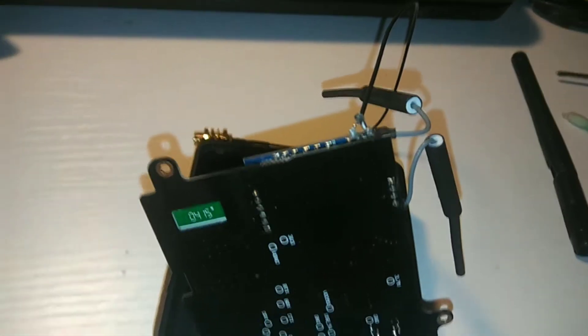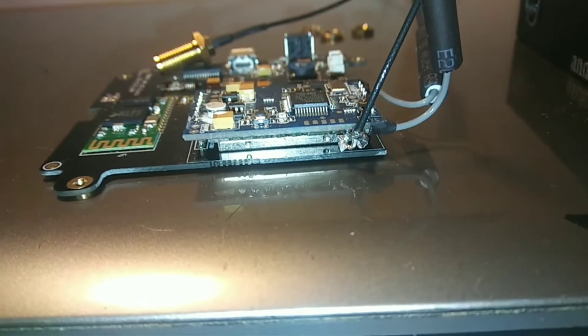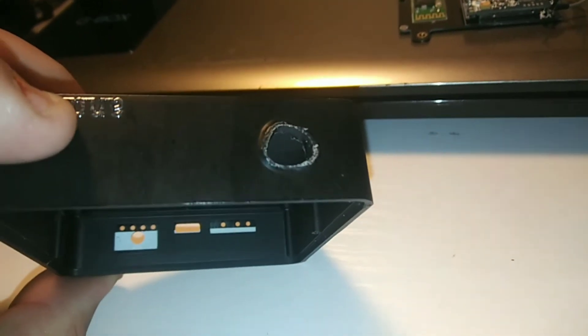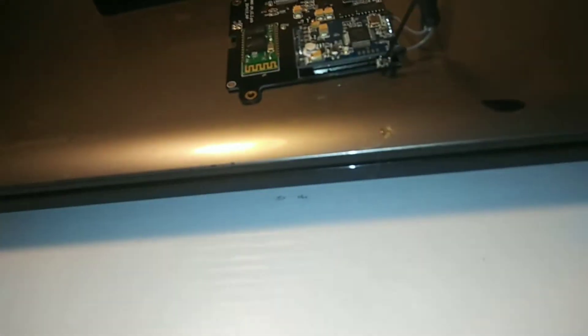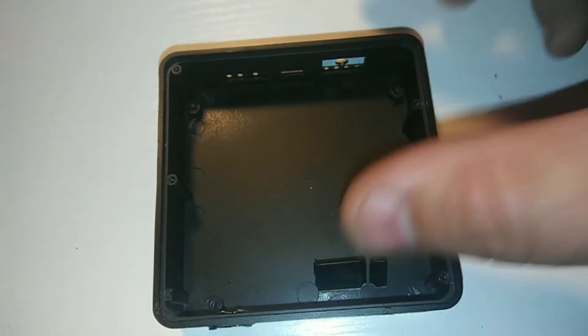We're not touching anywhere — we seem to be good. I'm going to go ahead and hot glue this so that wire can't move at all. I extended both solder points out; we should have plenty of clearance. The wire is on there nice and good to the board. I went ahead and melted a hole right through this with my soldering gun. Now we should be able to stick the SMA jack right through there, tighten the bolts and screw on the antenna. I'm heating up the hot glue gun — I'm going to glue all that to make sure all those wires don't come disconnected and they have a little better hold so we don't have to rely strictly on the solder point. Hot glue has been applied so that wire can't move. There is a black piece holding part of this down — you're going to need to push and snap that off so that the hot glue can fit in there. This is what happens when you have to customize.